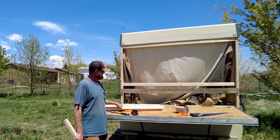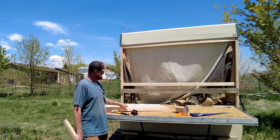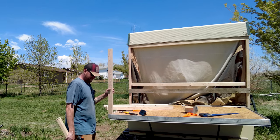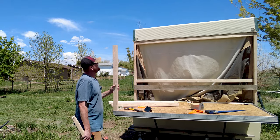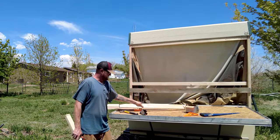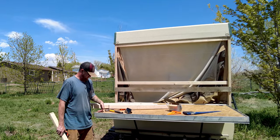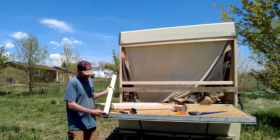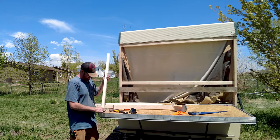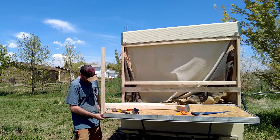What's great about it is the 2x3s that I used for the wall studs have this excess, so each one that I cut ended up being the perfect height. I think this will make a nice size room. There's this lip here, so I notched out the bottom of this 2x3 just so it slides in there and fits perfectly — right up against the metal.